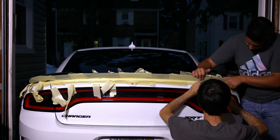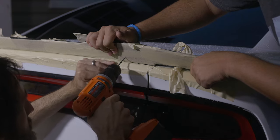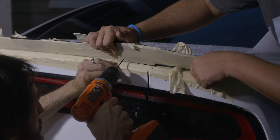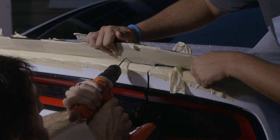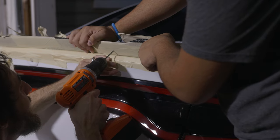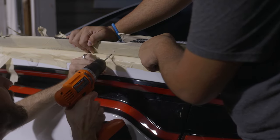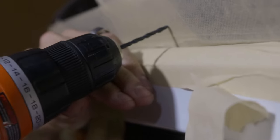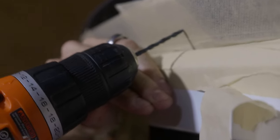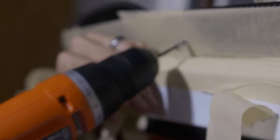Once the rivnut's securely in, you'll be good to go. Remember to drill dead center on the marker. Start out very slowly. After you drill your first few holes, you're no longer nervous — at least until you get the big drill bit out and realize these are little holes compared to the ones you're going to be drilling. If your drill bit gets stuck, just pull it back and then go back and forward a little bit.